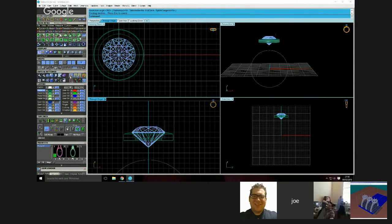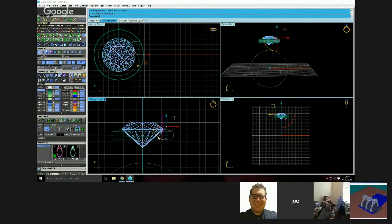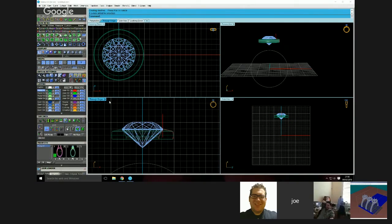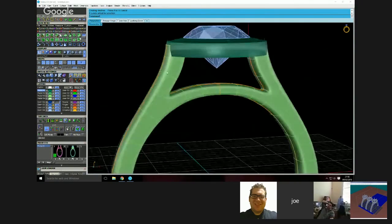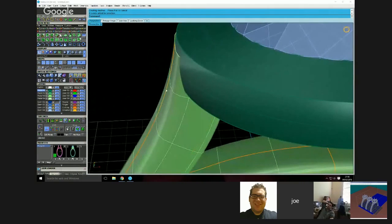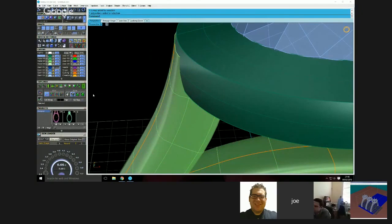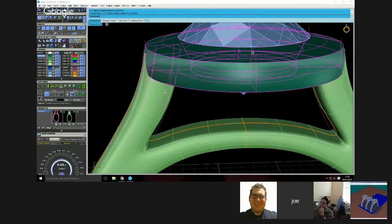When I've done it, I've got Rhino history on, which is important. Select them now, put them on the red layer. Let's bring that back. Okay, so this is too big now, but because we've done it in T-splines, it's not a problem. You've just got to select edges and select that. Oops, wrong button. There we go. So I can just pull that in now.